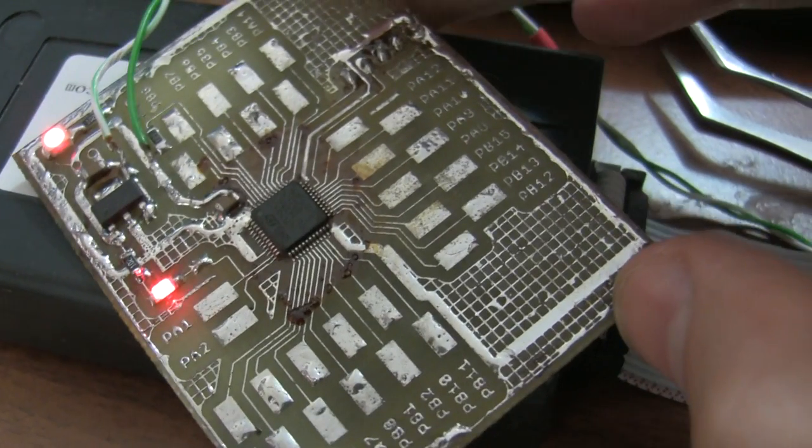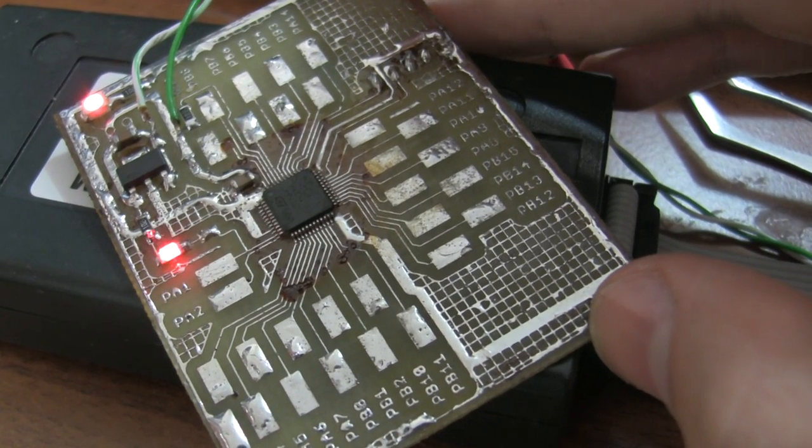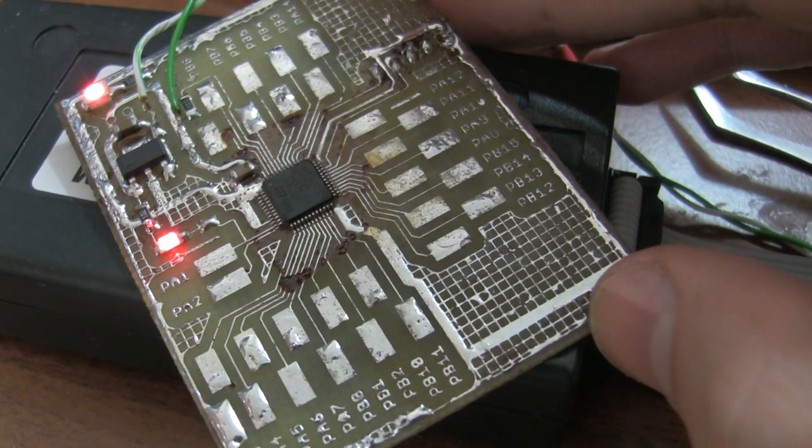This is acceptable provided that the sensitive ARM core is powered by an internal 1.8V linear regulator inside the microcontroller. This board proves that you can have a working ARM on a single-layer, single-sided board.